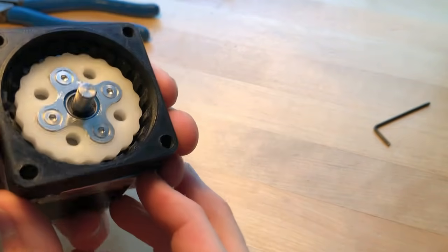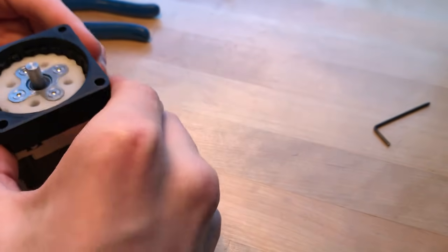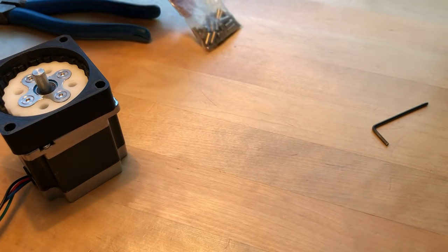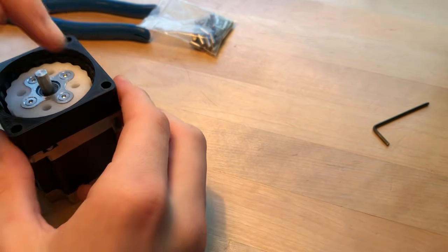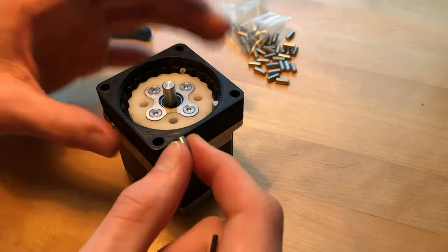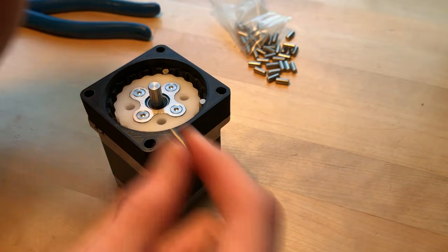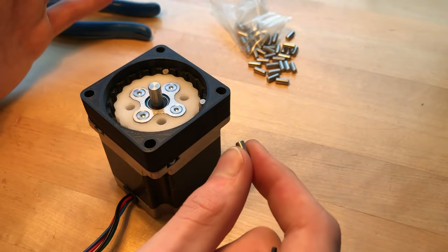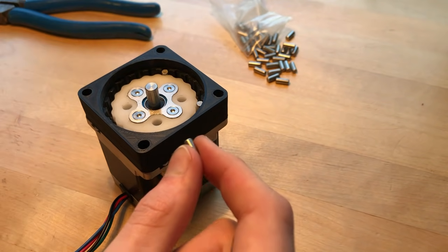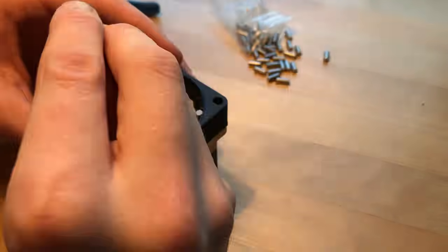So this 3D printed piece, you can see that there's holes all along the rim there. Those are 4mm holes that will allow for these pins to go in them. And these pins are what will make up the outer ring. So there's 21 pins that need to go in here. I think hypothetically, I could put in as few as 3 pins and it would still be the exact same mechanism. Like nothing would change if everything was perfect. So if I wanted to reduce friction, I think it could be as simple as just removing the pins and then it shouldn't affect the actual mechanism.